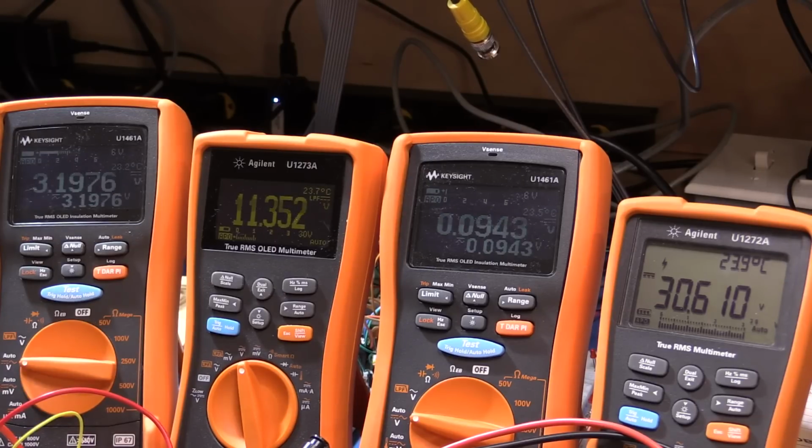And now if I take the voltage control pot and start cranking it down, you can see that I'm bringing the voltage down, and we're keeping in control still. So I can take this down to say 20 volts quite happily. All right, and I've got a 10-turn pot on here, so I can get it fairly accurate. And it's sitting there quite nicely. And yeah, so it's sitting in a nice static state.